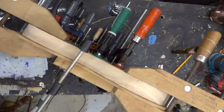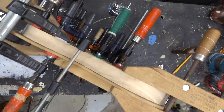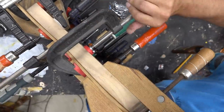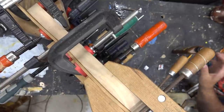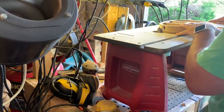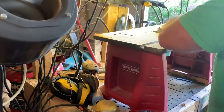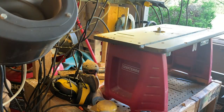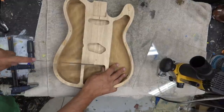Those old-school clamps are probably older than me — made in the USA. Some of the clamps I have, I've permanently affixed felt pads so I don't ever dent the woods. I love those two-sided clamps from Grizzly; I bought those years ago and wish I had more of them. We let it dry for a couple days — hide glue takes a little longer to dry — then take it upstairs to the Craftsman table router with a top bearing bit mounted upside down to clean it up.